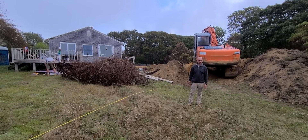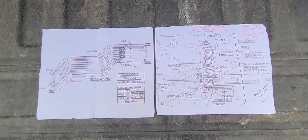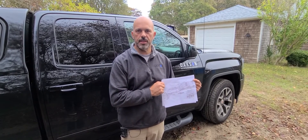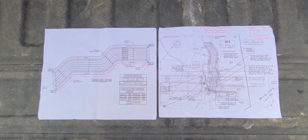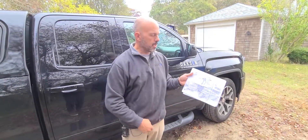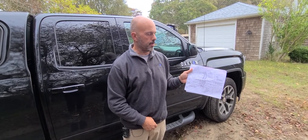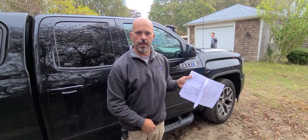What isn't evident at this perspective is that it's a very irregular shaped field. Let's go take a look at the plan. As you can see on the plan, we have a very irregular shaped bed, serpentine shaped, about 100 feet long with six runs of Perkrite drip dispersal tubing. It's pretty close to the house, with some corners tight to the house — not an easy installation for moving equipment and dirt around, but from a Perkrite perspective, it'll go very nicely following that irregular shape.